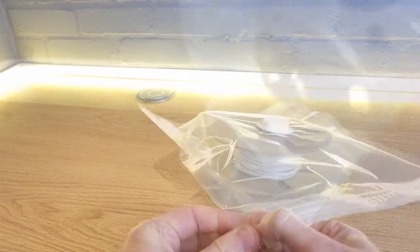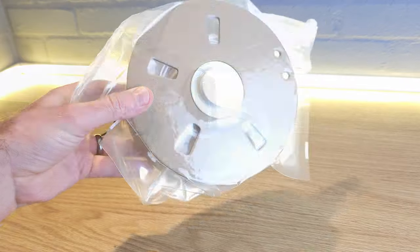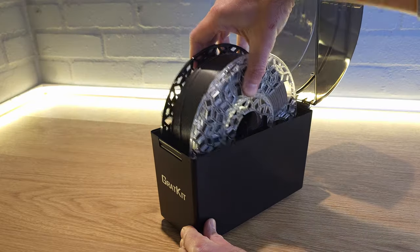I love that cardboard reels are more environmentally friendly, but they can soak up a lot of moisture from the environment. If you seal your filament and reel away while the reel contains moisture, there's a good chance that some of this moisture will transfer to your filament. For me, therefore, drying brand new filament and its reel is something I like to do, especially if the filament is known for being more hygroscopic.